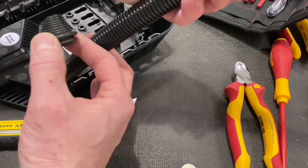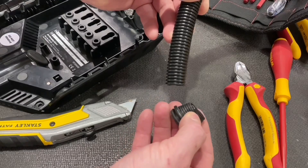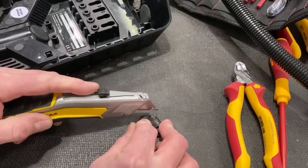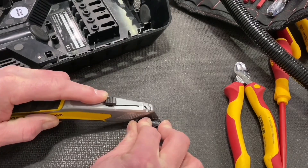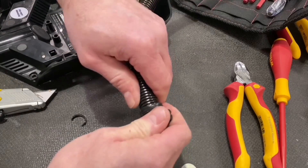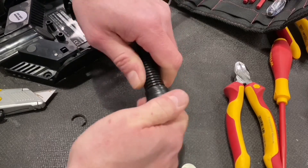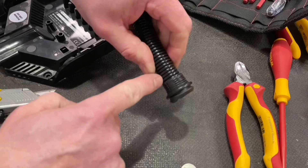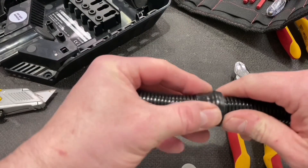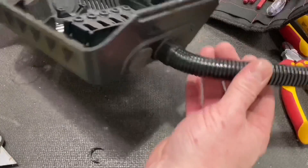We're going to use the bungs again - we used them with the tough sheath cable on top of the actual enclosure. I'm going to trim this back in order to go over the top of my Flexicon. I like a tight fit, so I'm going to be pretty slim with the cut in order that it securely fits around the Flexicon. The charger has a different IP concept, so we're not using the IP66 rating of the Flexicon at this stage - check out the other video about the charger to find out about that.